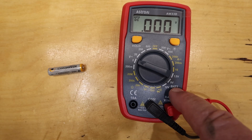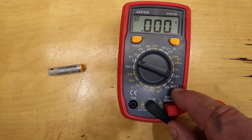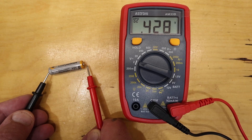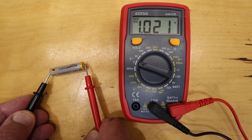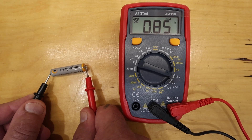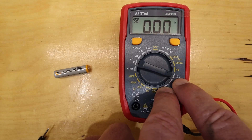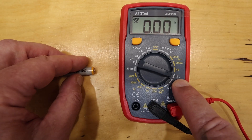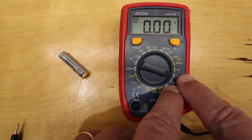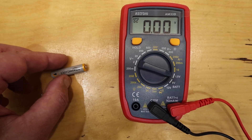There are settings for measuring batteries — 1.5, 9, and 12 volt. You might wonder what the difference is from the DC volt scale, since batteries are DC elements. This AAA battery is fully discharged — on the DC voltage range the meter reads about 1.02 volts. But switching over to the 1.5-volt battery measurement range gives a different reading of about 0.8 volts. The battery range is basically a DC voltmeter with a bit of resistance added, which gives a more accurate reading. The DC volt range has very high impedance, so the battery can produce voltage at very low currents, but the battery range loads the cell down for a more accurate reading of its capabilities and status. 0.8 volts indicates a discharged battery.